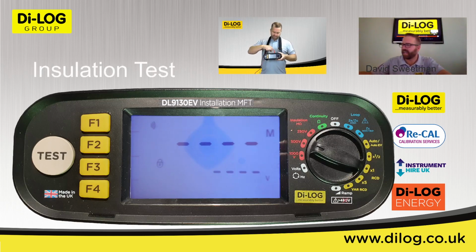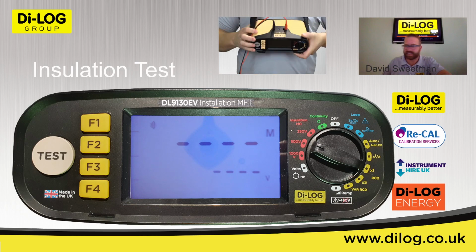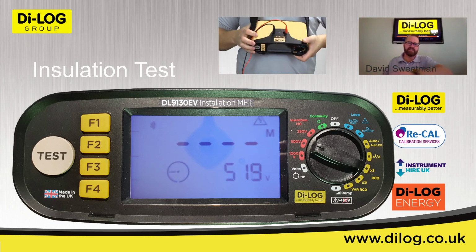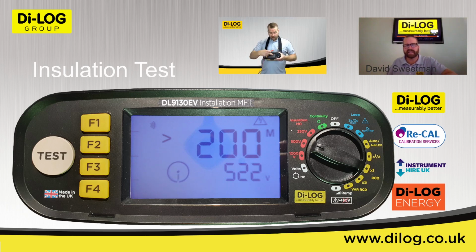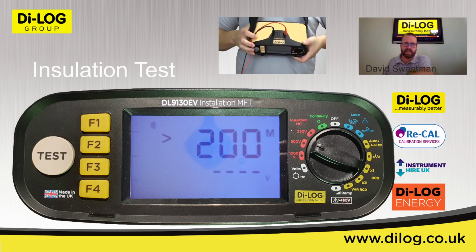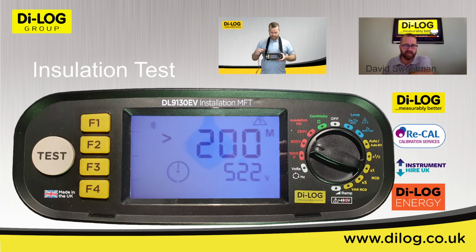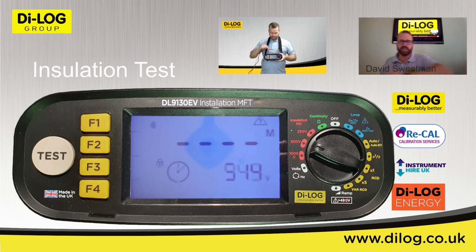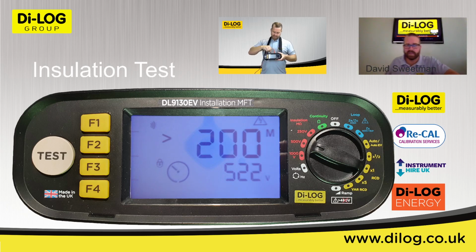So insulation test, it's an insulation test. We have got some safety parameters on here as well. Performing the test, it runs a 3-second test at 500 volt. Then it will give you an idea. If you want to run it for slightly longer, you can just press and hold the test button, and it will run it for as long as you want to hold your finger on, really. If you don't want to hold your finger on, you've also got a lock option as well, which will just run the test, hopefully continuously, until you stop it as well.